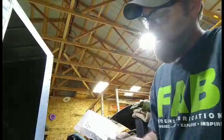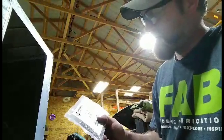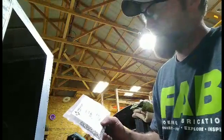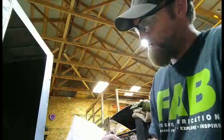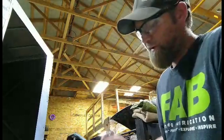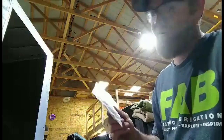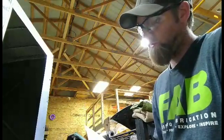If any of you guys are wondering, this is what I'm using. They're 8 by 5/16, 1100F aluminum solid rivets, round headed. I have 8 by 5/16 and I also got 8 by 7/16, a couple different sizes, and they make these in all sorts of different sizes. I just happened to buy these ones from, they're called Henderson Rivets.